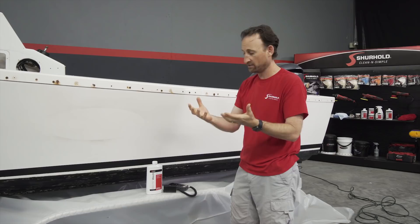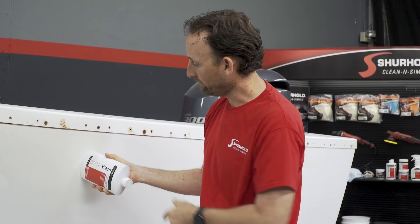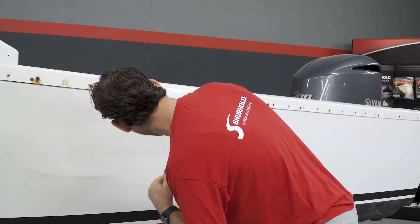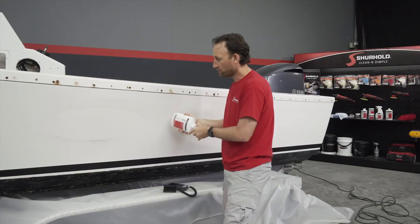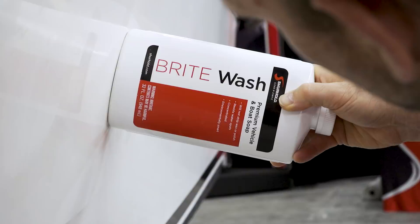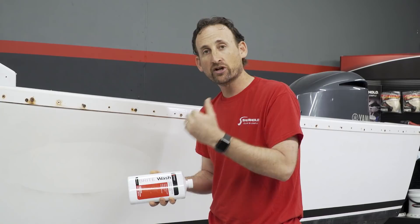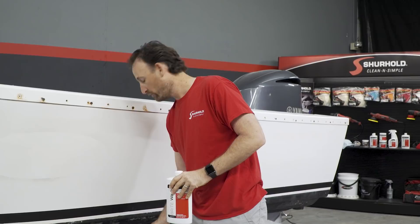At home, you can use the bottle test method: take a bottle, lay it vertically against the hull, and put your head at about a 45-degree angle from where the bottle contacts the boat. In areas reading in the 20s, you can see very little — maybe up to the black line, but no clarity at all. In areas hitting the 50s, you can see about halfway up the bottle, but still no clarity to read the words. Once we get up into the 80s and hopefully 90s, we should be able to see the whole bottle and read the label clearly. That's a great way to track your progress at home.